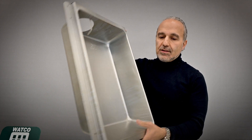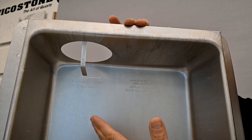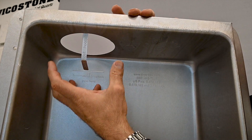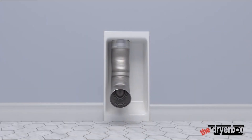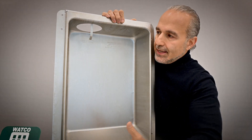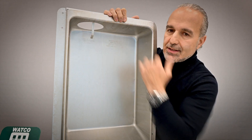The other solution for pushing the dryer right to the wall is the Dryer Box — almost a no-brainer, we use it on every project. It's positioned between the studs behind the dryer. It has one hole for the vent pipe and a knockout for a gas line, so both gas and vent connect here. It gives you a cavity inside the wall so all the excess pipe bunches up inside, giving a nice direct flow whether going up or down. Once finished, drywall sets flush to the sides, it looks great, and allows you to push the dryer right to the wall with no gap in the back.